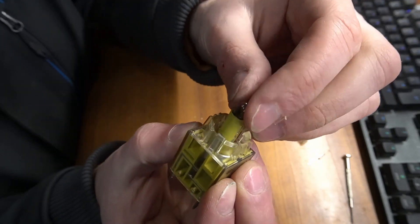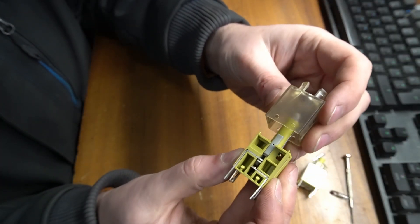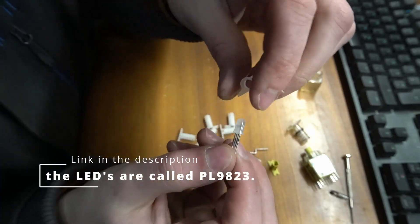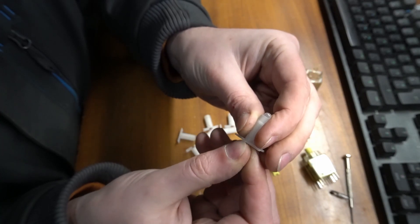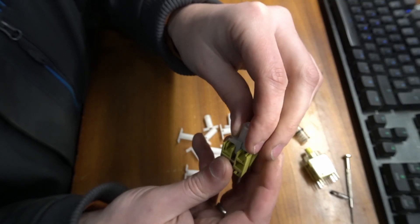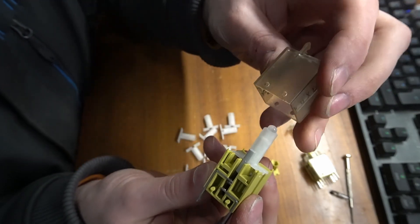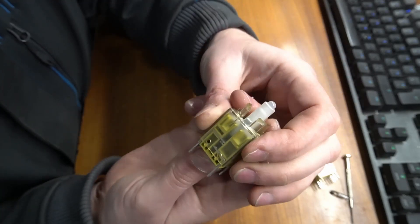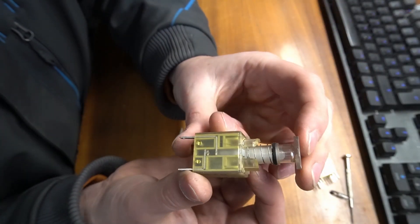This is one of the original switches. To glow it up there is a light bulb inside. I replaced them in all the switches with digital RGB LEDs. To mount them in the switch I 3D printed new holders for them. Using digital RGB LEDs is very nice since it allows me to easily redefine the color of each switch and also lets me change the colors if its state changes. All LEDs are connected to just one pin on the Arduino. This way we can theoretically connect hundreds of such LEDs — only the required soldering is a bit painful.